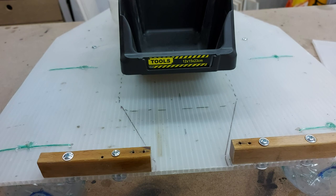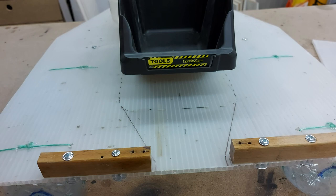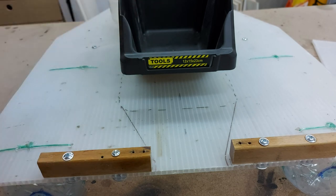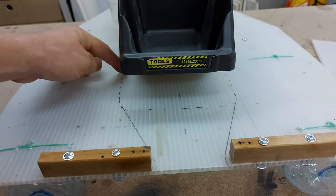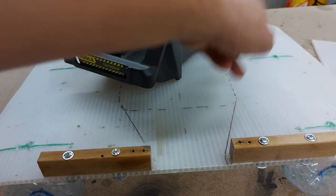The problem that I now have is the placement of the load bucket, and since the rudders are now on the back, I had to move that bucket to the center of the boat, and for that to work and be able to dump out all the material from there, I'll need to cut out this piece of the plastic all the way probably to the pivot point where the bucket will be mounted here in the back.